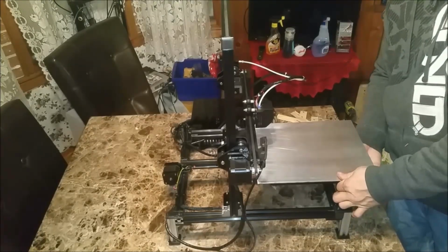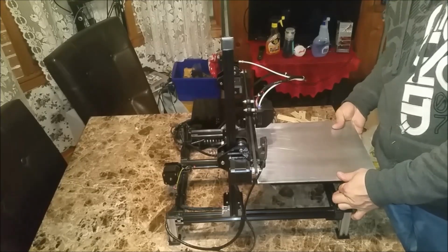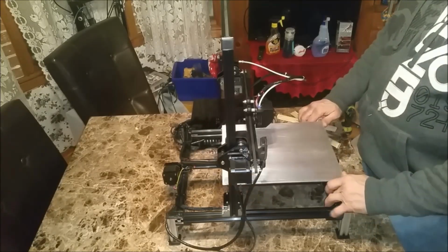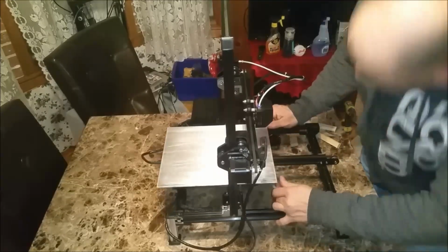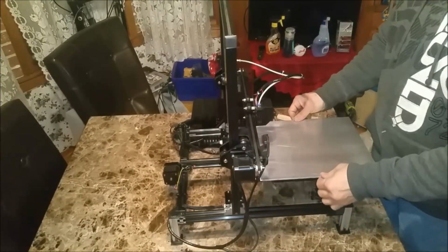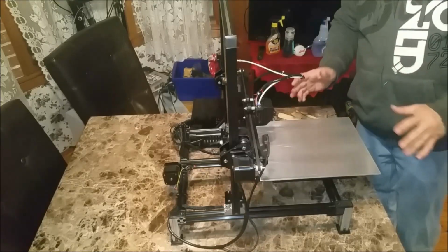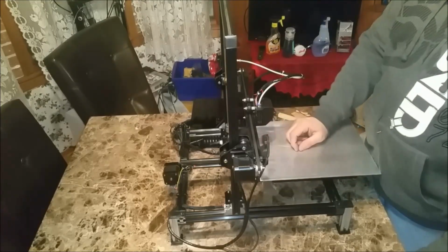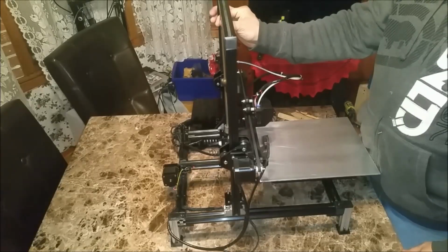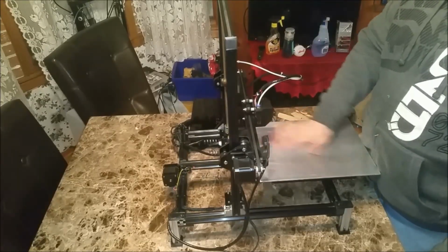As I was saying, I've had a few people on the Facebook page for the X3, as well as the CR10, and a few of my videos on YouTube ask me about leveling the bed. Everybody's going on about auto bed leveling sensors and whatnot, but I think those are absolutely unnecessary, unless you're moving your printer around a lot and you're constantly doing things to your hot end or whatever. The only time I ever have to re-level a bed is if I'm playing with the nozzle, replacing the nozzle, I move the printer around, or I'm doing something stupid where I jar the printer, or I accidentally turn one of my threaded rods when the steppers are unlocked, and then I throw my gantry out of balance with the bed. It's no longer parallel.